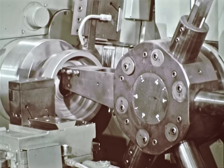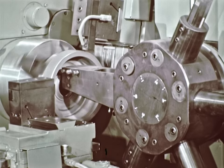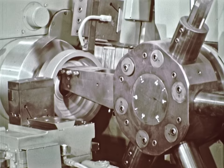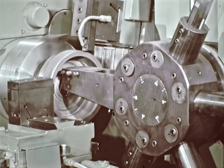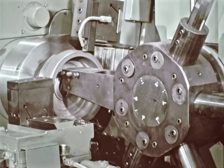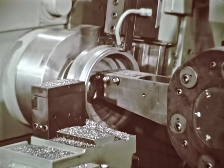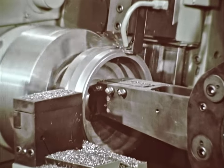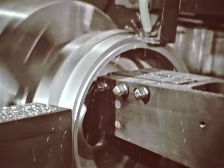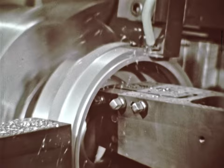Material is 290 Brinell gray iron. Immediately, and under tape control, all tool stations — front, rear, and turret — start bringing the casting down to size by taking off excess metal. This is maximum productivity. Parts are made at the same rapid pace, hour after hour. Constant operator attention is unnecessary.